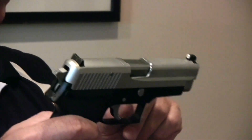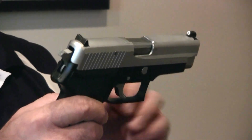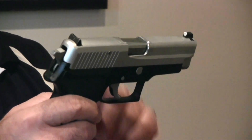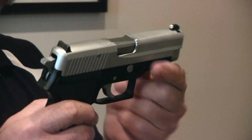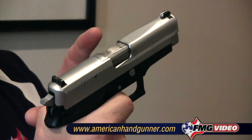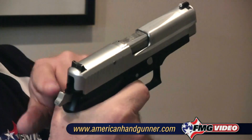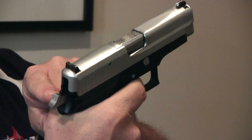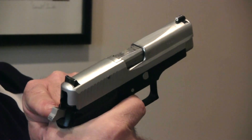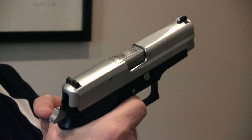A SIG has a hammer drop on it, so we'll manipulate it to get us back. Just like a revolver, this SIG P225 has a double action and a single action mode, and it does exactly the same thing. In the double action mode, pulling the trigger will cock the hammer and then fire the gun. Now, after that, the slide will cycle, cocking the hammer. So after trigger reset, now it's in single action mode, which means a pull of the trigger does one thing — fire the gun.